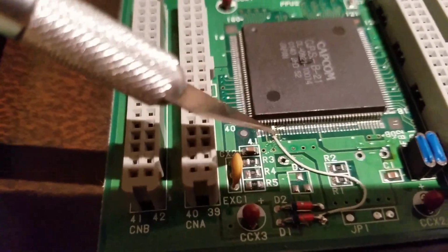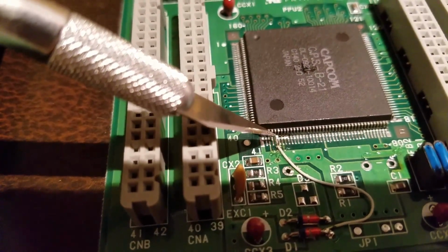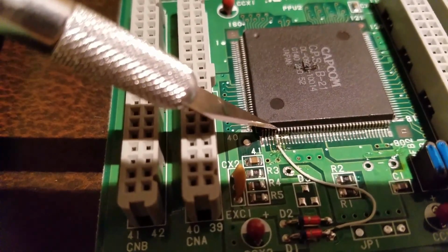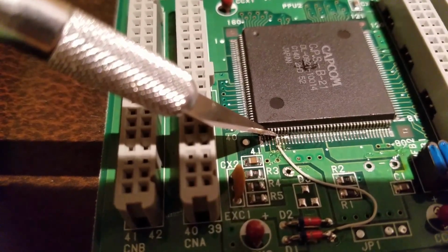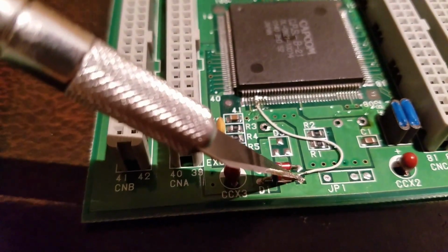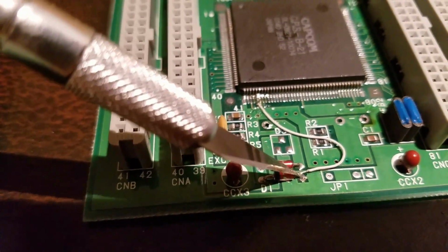Alright, next thing you do is those same 2 pins, 45 and 46. If you're not good with fine soldering, I'm not very good with it, but it turned out okay. You take a little wire and you solder a wire connecting 45 and 46, which I believe right here, and you run the wire to a 5-volt supply, which this is the closest one right here, so you can connect it right to this pin here. There's a picture on that website as well, the Dead Battery Society.